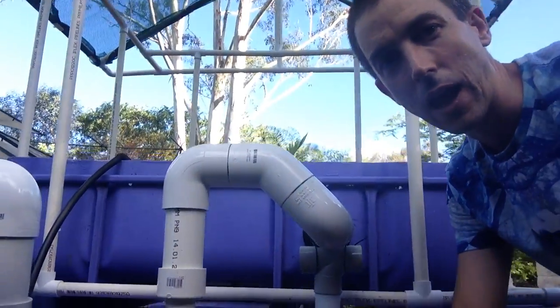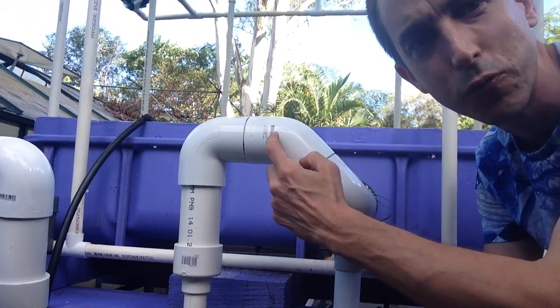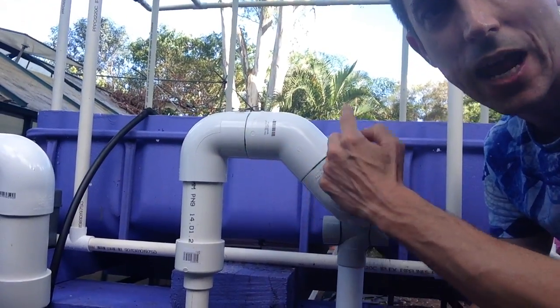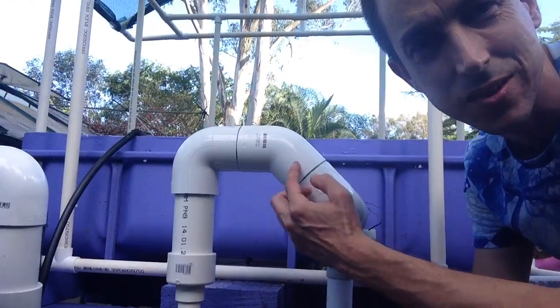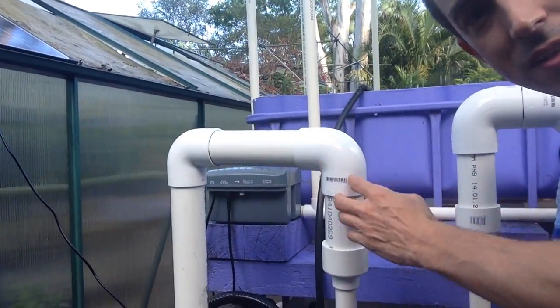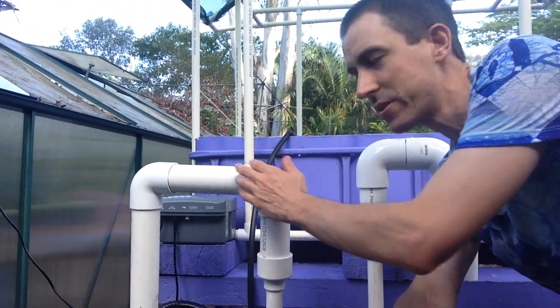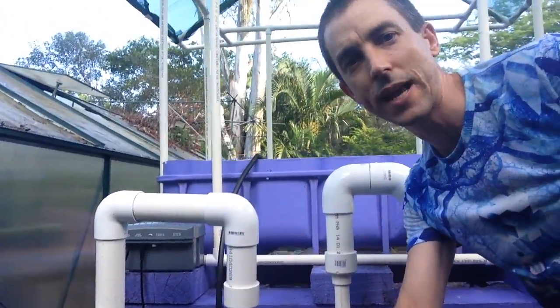Normally this would be a 90-degree angle, but I put a 45 in here to get the height that I wanted — when I had 90, it went up too high. That's why it might look a little bit funny for a 45-degree angle. Whereas this one here, as you can see, is a 90-degree angle. This is what you'd normally see as a U-siphon and how the U-siphon gets its name from that upside-down U shape.